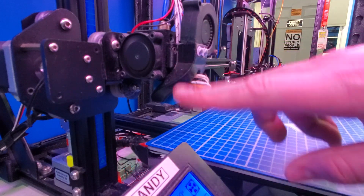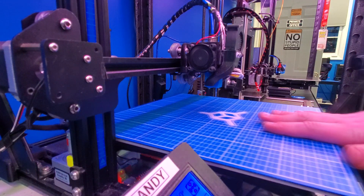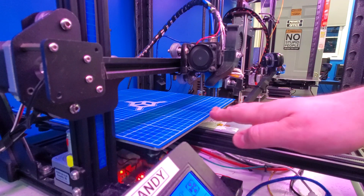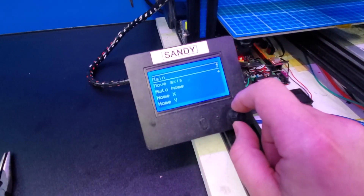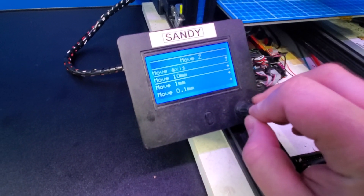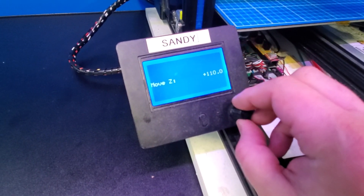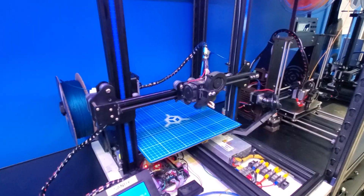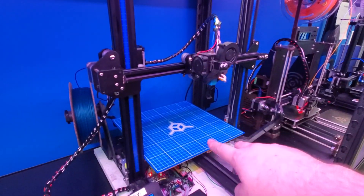The first thing we're going to need to do is get our nozzle out of the way of everything else on the machine. I usually like to have mine in the center and then push my bed towards the rear of the printer. Then I'm going to move my Z up so I have room to work between the nozzle and the build plate. On your machine, press the menu button, go to prepare, move axis, move Z, and move 10 millimeters. Give yourself about 100 to 150 millimeters if you have the Z height.